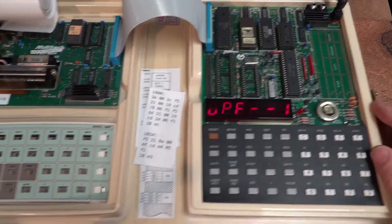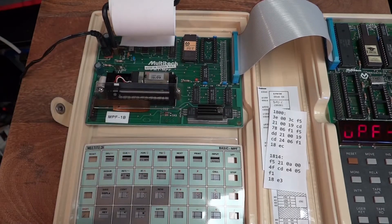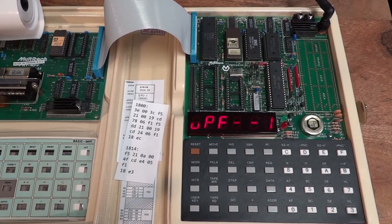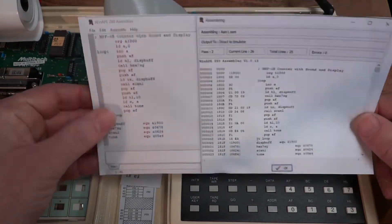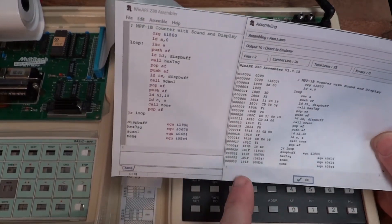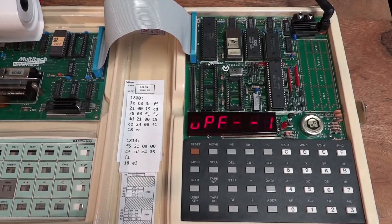Next I'm going to present the printer. The printer has its own EEPROM which contains the disassembler — a symbolic disassembler, not only a memory dump facility, but you can actually get the mnemonics from the program. The way I produced these programs was using a PC assembler program. You would program this in assembler, get the opcodes and hex codes from the assembler output, and print them out to enter them easily.